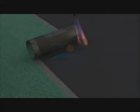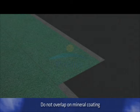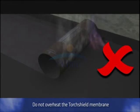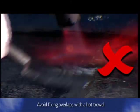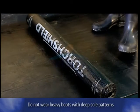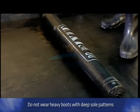For Dr. Fix-It Torch Shield AM range of mineral membranes, the sheets should be overlapped by roughly 100 mm on the factory provided selvedge edge, taking care not to overlap on the mineral coating. Do not overheat the Torch Shield membrane — avoid heating it to the point where it starts smoking. While bonding overlaps, avoid going back over the overlaps with a hot trowel, which could damage the heat-sensitive reinforcement. Always wear flat-soled canvas shoes. Do not wear heavy boots with deep-soled patterns while applying Torch Shield, as they may leave deep imprints in the softened membrane.